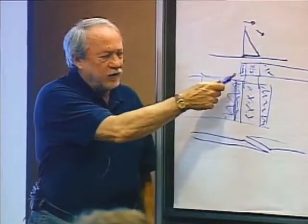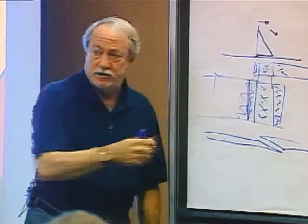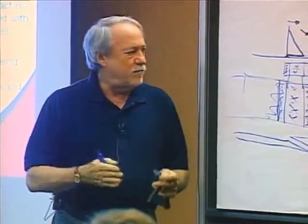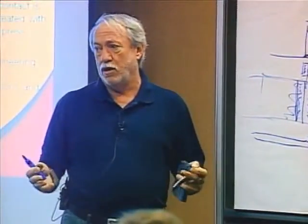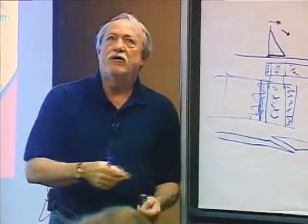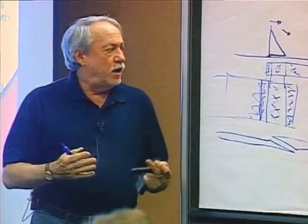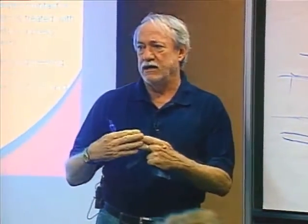When the people do these kind of splices in the field and sometimes in the shop, if a little catalyst is good, then a whole bunch is really good. Absolutely wrong. The least amount of catalyst you can use is way, way better than more for a myriad of reasons. More catalyst means your cooking times or your curing times are way off. If you use too much, you may need 3 times the amount of time for that to set right.